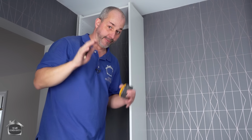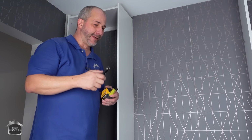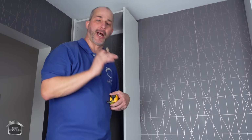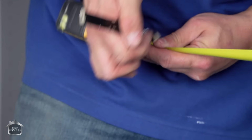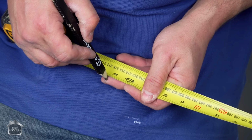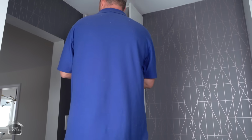Now that might sound unfamiliar, but when we're working and we're taking a measurement, if my measurement is just a little bit less than 85, I don't want to say 84 and 7/16. When you're on the saw, if I make a measurement, I say, give me something 84 or 85 shy. You line up 85 and let me just give you a little example here. If I were talking 85, I'm going to extend my whole tape. Why not? So if I'm making a mark at 85, usually I'll make a mark at the point and the thickness of the blade, so the saw guy knows to cut that pencil out. If I say 85 shy, when he's making his mark, he'll just go a little bit left of the mark. And he'll still take the pencil out. That's just a really effective way to communicate.